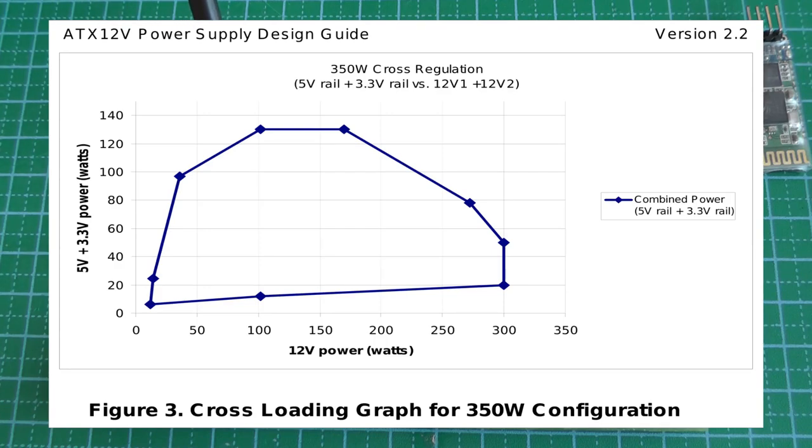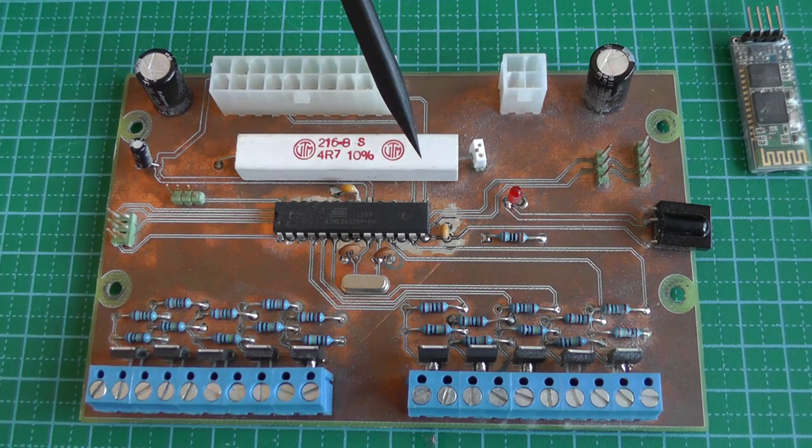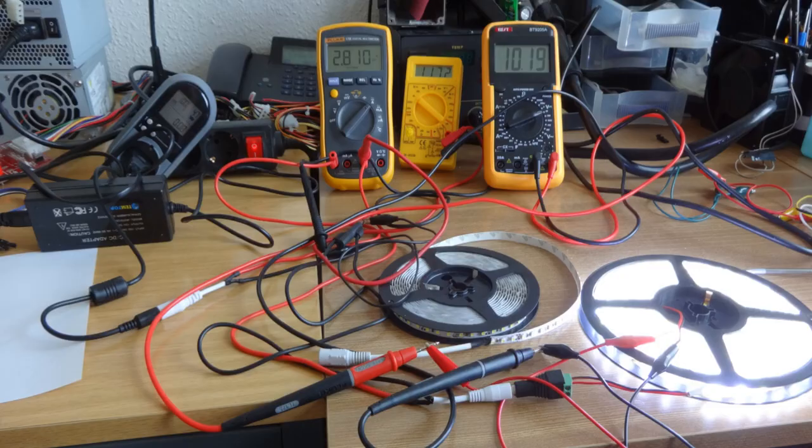Since I only use the 5V standby rail and not the main 5V rail, the 12V rail would be less stable. The power resistor at 5V and 4.7 ohms burns energy deliberately on the 5V rail to stabilize the 12V rail. I tested different power supplies with and without a load resistor using a spreadsheet of voltage measurements — the ATX supply gives better regulated 12V with some 5V load drawn simultaneously. This behavior relates to how the switching regulator is implemented in these ATX supplies.